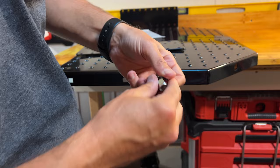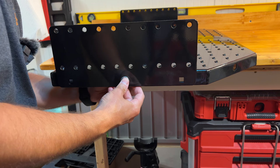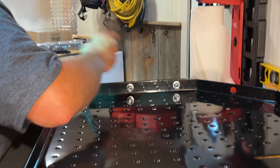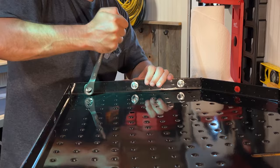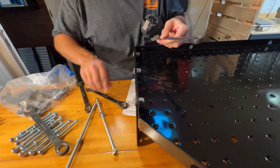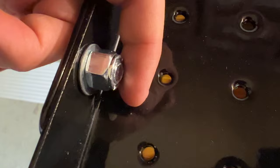I'm just going to put the bolt through the square hole here, put a washer on the back side, then a nut and repeat the process. I'll pull out some ratchet wrenches — this part doesn't require any adjustment so I'm just going to tighten it right down. I'm using either a 9/16 or 14 millimeter for these nuts — basically the same size. The bolts are just long enough to engage the nylock but don't stick out further than the nut itself, which is really nice.